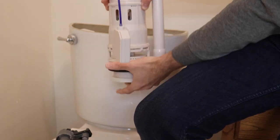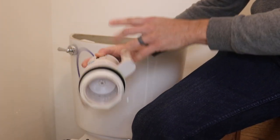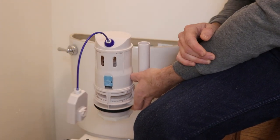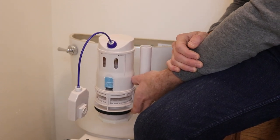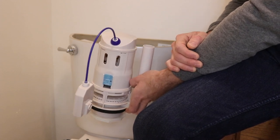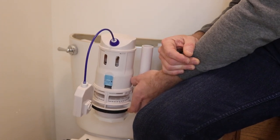It's a little bit of a pain. You're going to need to get this part from Jacuzzi. At very least, you'll need to get the rubber ring. I don't know if they sell it separately — I was sent the entire unit as part of a replacement. They did a pretty good job replacing everything under warranty; they just sent me the new parts. We have four of these toilets, and they have given me plenty of parts for things already. So they're a good company to work with like that. And that's how you fix a hissing Jacuzzi SWP2 dual flush toilet.